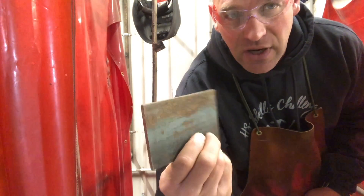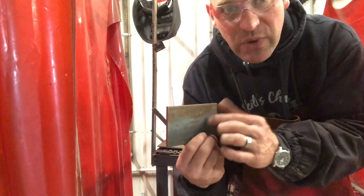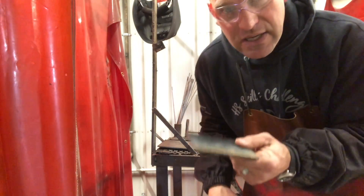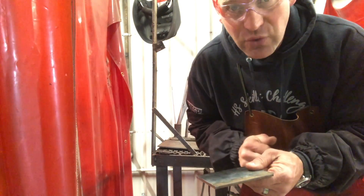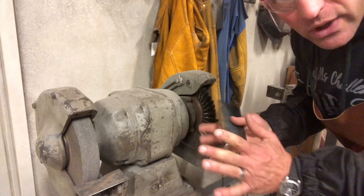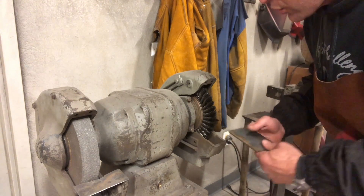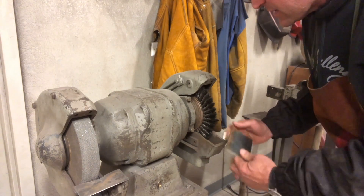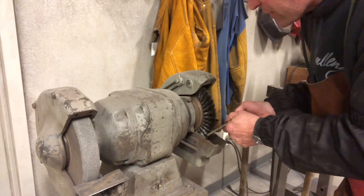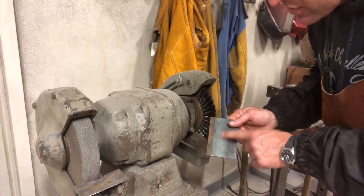We can't weld successfully on a piece like this. We need to remove that rust and we need to remove that mill scale. The first thing we can do when we cut this is wire brush it if it's not that bad, but what I prefer is to either lightly grind it or take it to the wire wheel. This is our wire wheel on the grinder. When we use this, we don't want to wear gloves — gloves can be grabbed by all these wires and suck your hand in there, and that's a really bad day. We have to make sure we're using the guards so we don't get our piece sucked in there, and we're not pushing it too tight to where it could grab and pull in. We're going to take off this rust and this mill scale to get down to the bare steel.